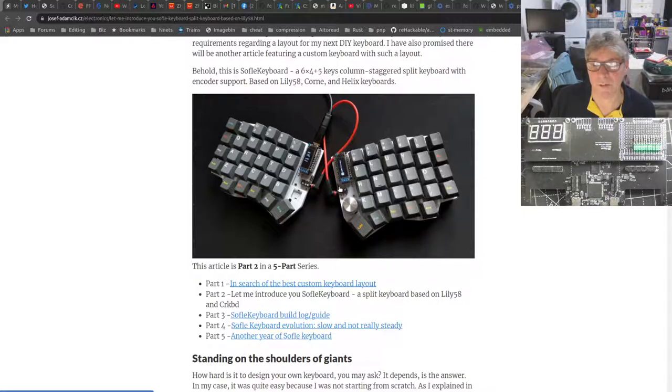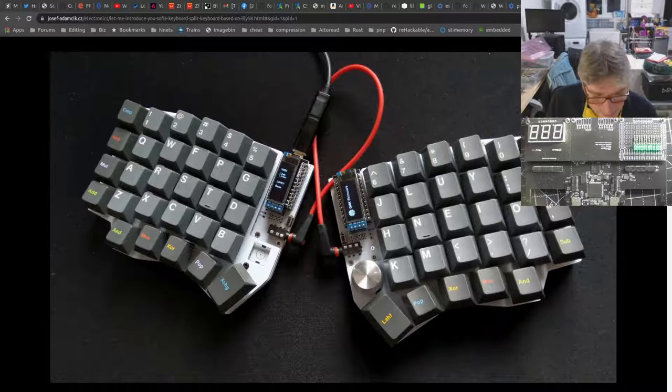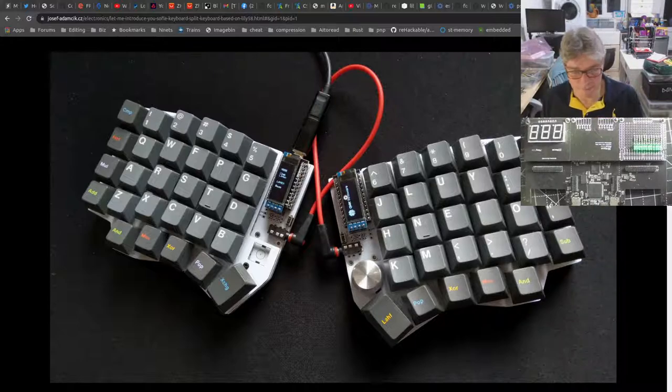Now, what I'm proposing is you could very easily carry both of these cables back to those two jacks, because they are 3.5 millimetre jacks. So the other end of these two cables would be our deck, you know, our BlackIce deck. And instead of having these on here, you basically have an FPGA on each, a really low cost one. That's if you want to go the whole custom keyboard route. Otherwise you can go with a USB type solution, or if you've got existing PS2 or whatever, you can do that. What do you think?